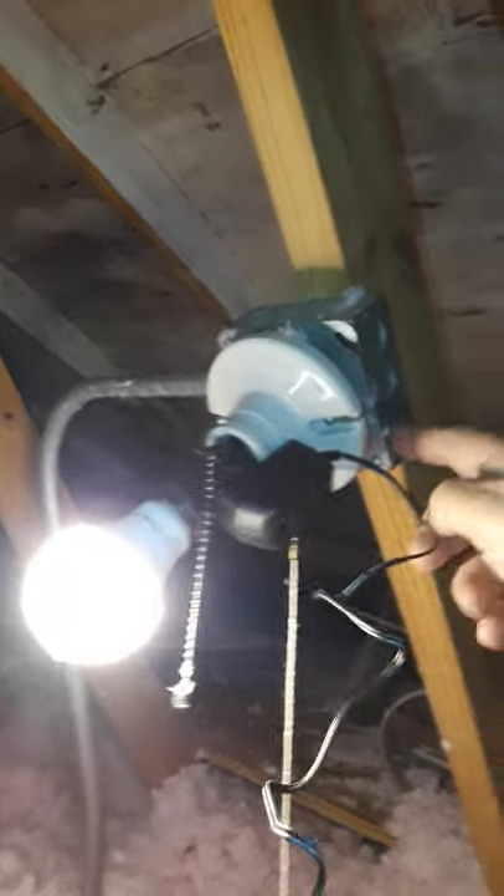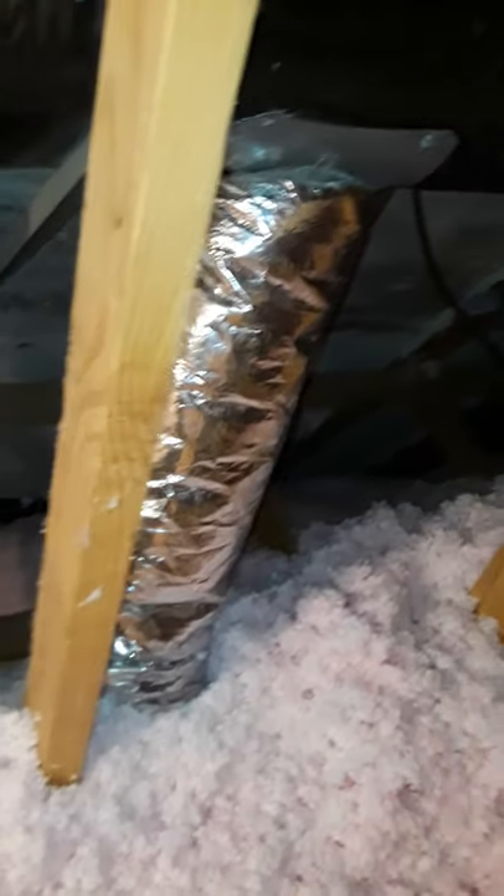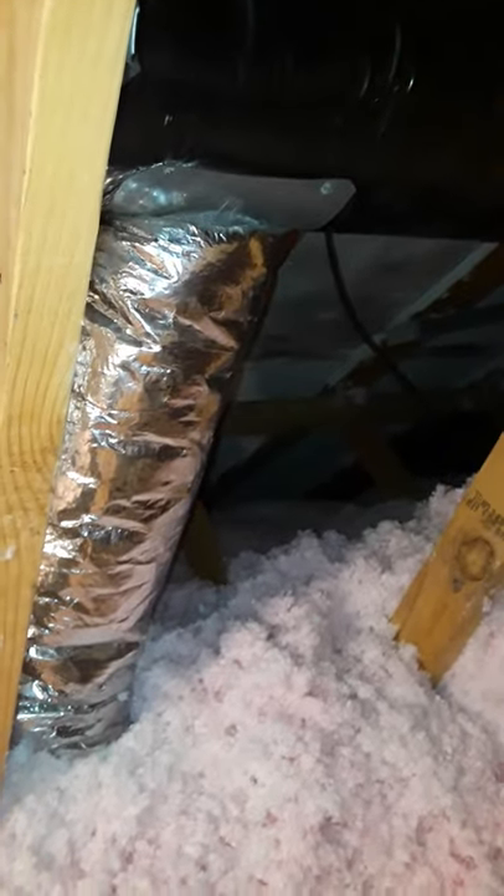Just doing some electrical work. We're going to take that box, get rid of this garbage, and tap through all the way down with some half-inch conduit. I got the attic fan — we're going in there with it. I want to put a box in there at about 41 inches with more outlets, just in case.